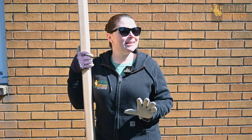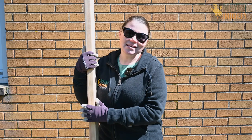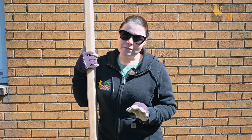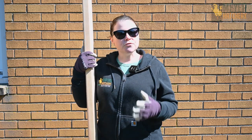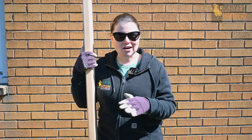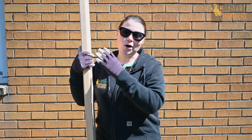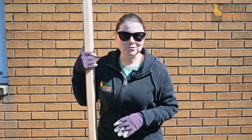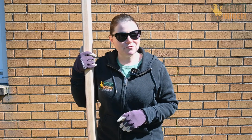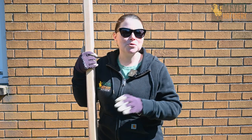To make this stand is incredibly easy and you don't need a lot of materials. I'm using three two-by-fours like this one here. The great thing about this project is you can change it depending on how tall you want your stand to be. For mine, I want it to be about four feet tall and three feet wide. If you want yours to be a little bit taller, you can definitely do that just by adjusting how much wood you purchase and how long you cut your pieces. To make one like mine, we're going to cut four four-foot-long pieces and one three-foot-long piece. Save your extras and you can use those for braces on the side, which I'll show you when we get there.